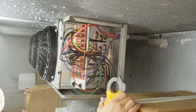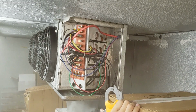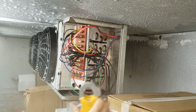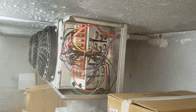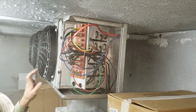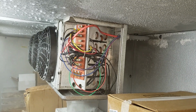Okay, so we've got the bottom of the coil heater, the drain pan heater, and then we have 2 in the coil. So yeah, we're looking good. I don't see a problem there. Everything else is looking good. My limit switches, like I had mentioned, I don't like how the fan started right up when I turned it on. So we're gonna quote to replace the limit switches also. But other than that, everything else is working good.